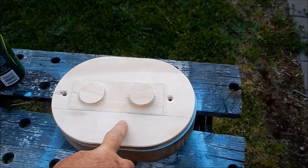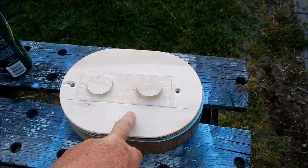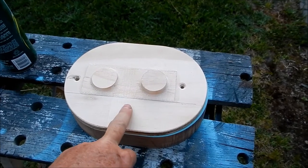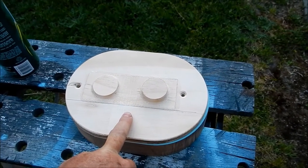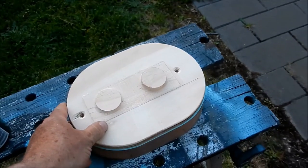So something's happened here. When I created these parts, I do what's called a derived part, and I scale it up 1.5% to accommodate for the shrinkage. But for some reason, this is machined out 1:1. Now, I'm sure I did upload the derived part. Maybe I didn't, maybe I did. But we need to go back and find out what I've done wrong.